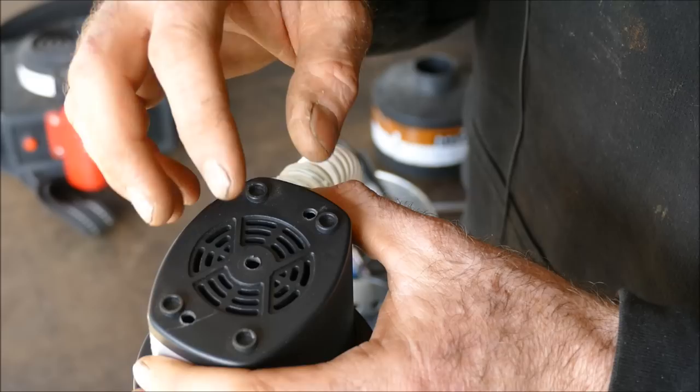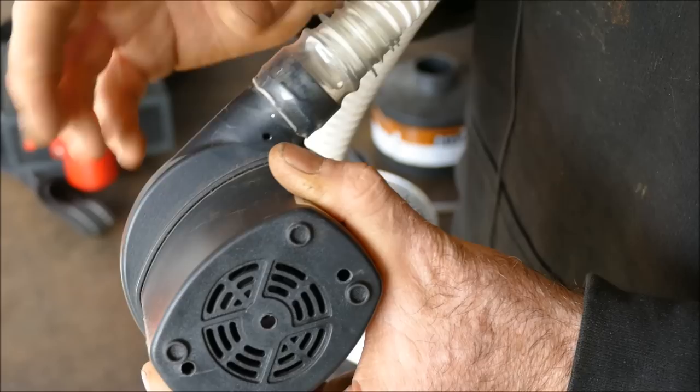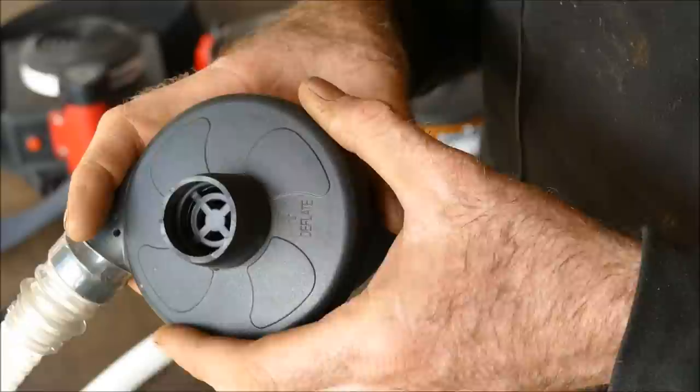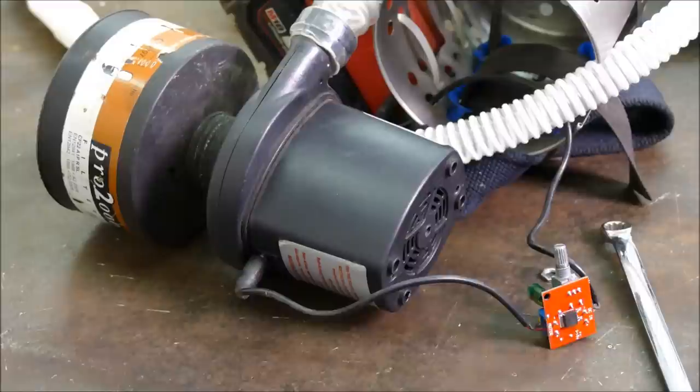What I'm going to do is a smoke test to see if it's pulling smoke into the motor side — if so, that's a bad idea. If it's blowing away, that's brilliant, meaning it's all under positive pressure. People are also concerned about the little holes, which are a safety feature so the motor isn't over-straining. The key detail is that this unit produces enough pressure to deflate something, so it has enough energy to pull air through the filter.